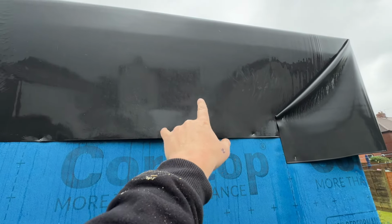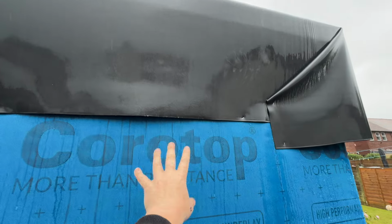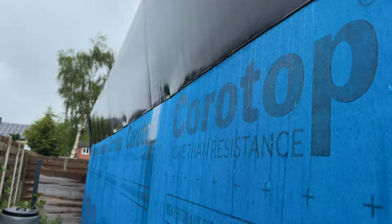So the next thing I'm going to do is tackle the ventilation system. The first part of this is literally just running a wire to somewhere on the back wall. What I need to decide is where the external fan is going to live. It's going to be in a waterproof box, so we need to get a 1.5 cable from this location just behind me to somewhere on that back wall. Now what I normally do is just work out externally what room we've got. I think the back of this is plenty, there's 1 meter plus, so we can put it anywhere on the back wall.